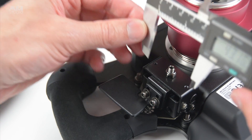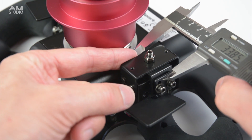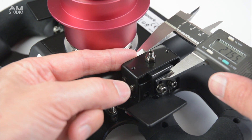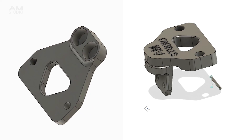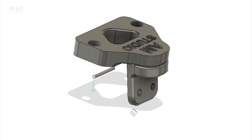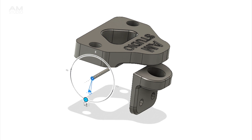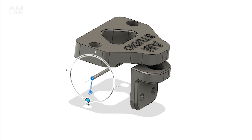The first step is to take measurements of the existing paddle assembly and locate a position for the magnets. Using the original design as a reference, the new part is then 3D modelled and a new top section to match the layout is also designed. These parts will have the magnets on each side that separate when shifting to give the paddle a tactile feel.